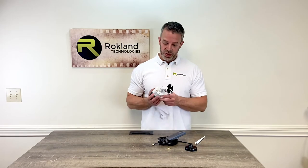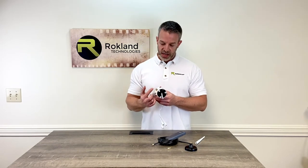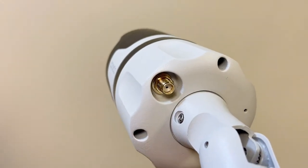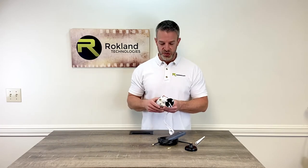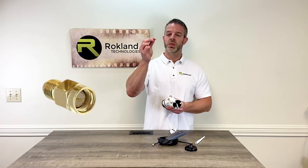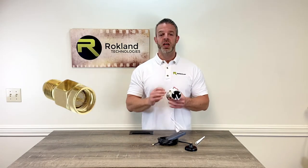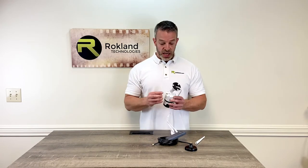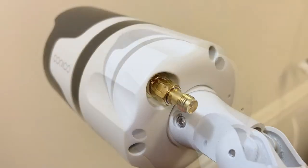You have to make sure the antenna is detachable — sometimes they look that way but they're not. If you can unscrew your antenna and see a port, this is either going to be an SMA female or an RP-SMA female. Some cameras use different connectors. The good news is both of our kits today come with a little barrel adapter, so whether you've got SMA or RP-SMA, you're covered. In our case we have the SMA female, so we are going to use this adapter and screw that on now so it's ready when we go to connect the antennas.